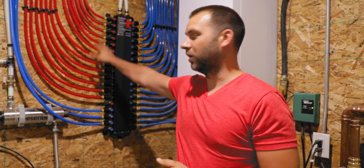That is all set. Since that video completed, we actually did get approval. All of my plumbing roughed in past, so that is awesome. You can see this is all hooked up down here. We did pressure test all of these, all of them that we could anyway, and nothing, I take that back. One shower leaked, had to resolder that a couple times, but other than that, we're good to go. So that is all set.